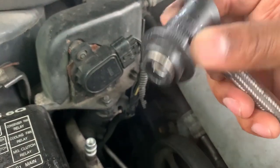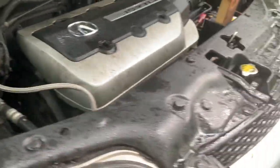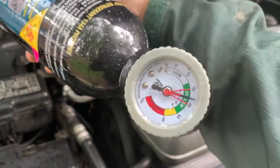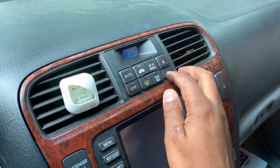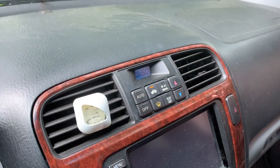Take your nozzle and just press it down like that. Now we're going to start this unit up real quick and see if we can get a quick charge and see exactly where our pressure is. We turned on the unit and now we're going to turn the pressure all the way down to 60, and then we're going to throw in some freon.